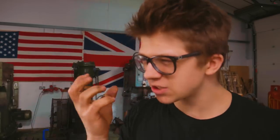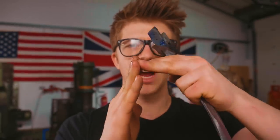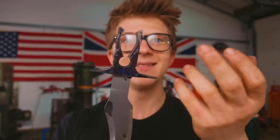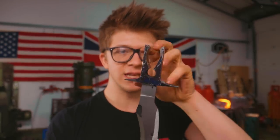After two or three days of being on the precipice of being ready for heat treat, we now have nice sanded, good radius surfaces, no hard corners — no hard 90s — and we shouldn't be getting any breaks anywhere. We have enough excess material proud of our scribe lines so that once it's hardened we can break through the scale and bring it to final sizes. We'll run three normalizing cycles and one hardening cycle. I'm gonna heat up the backside first since this is a little mass of heat and will keep its heat longer. On to the heat treat!